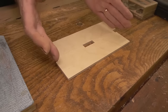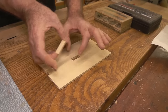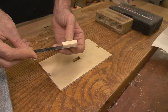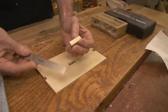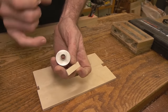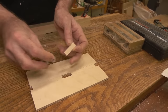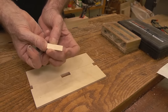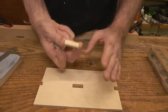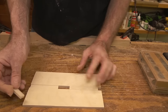You can easily set the length of the slot by chopping your spacer to whatever length you want. I chopped this piece to an inch and a half. Here's a little test: if I make an inch-and-a-half-long spacer, how long is my mortise going to be? Remember we're using a three-eighths router bit with a half-inch collar — sixteenth-inch offset on each side. So at each end of the gap you lose a sixteenth. Instead of an inch and a half, you'll be making an inch-and-three-eighths-long slot. You want to size your spacer an eighth inch longer than your actual desired mortise length.